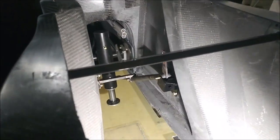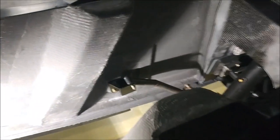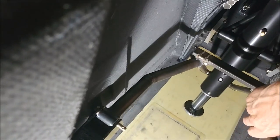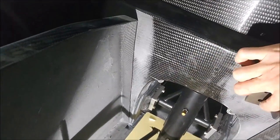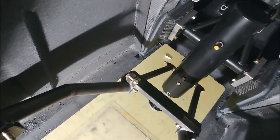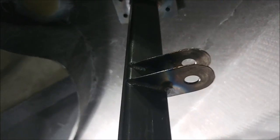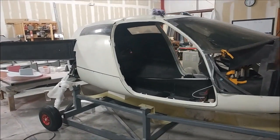Jeff's got most of the main gear retraction sorted, so now he's working on the nose gear. You can see that bracket Britt just welded goes between the two carbon fiber braces, supporting them while also serving as the gas strut mount to push the nose gear down. The other bracket will be bolted to the forward bulkhead — one end of the hydraulic cylinder attaches there, the other end goes on the arm. When the hydraulic cylinder expands, it retracts the gear, and the gas strut always tries to push the gear down to lock it in place.